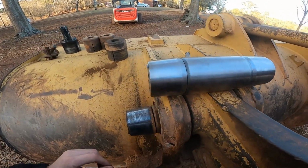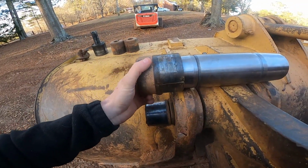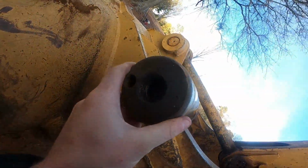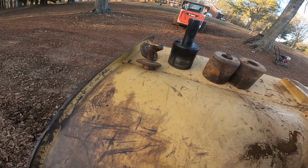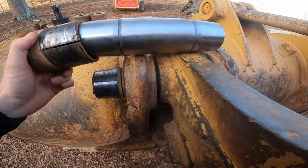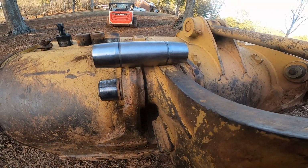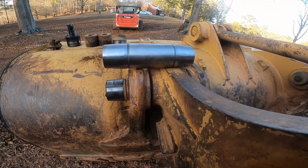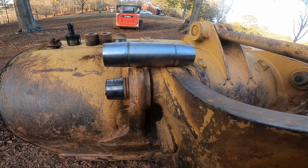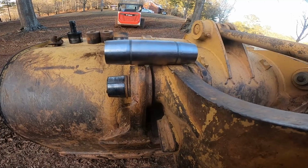The way it does that is you have this tapered piece here, and these are called collets, and they press up on here. It won't go all the way up on there, and I have the bolt right there. I got new bolts, but anyways, once it's in here you tighten those up, and then everything is tight. Basically it saves you from having to line bore your pin bores, which a lot of times you'll have to on a grease pin setup, because people will let the bushings go too far, or you nick the bore or something like that. But anyways, this is a pretty good design.